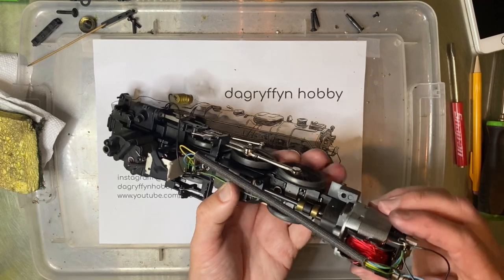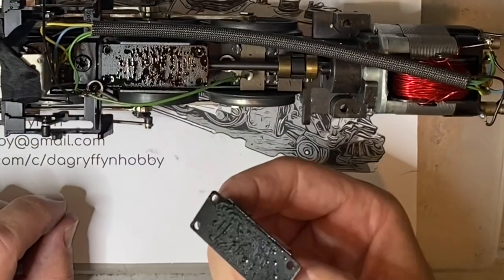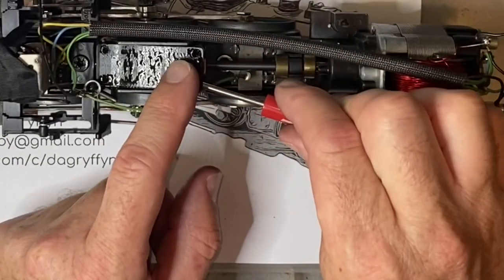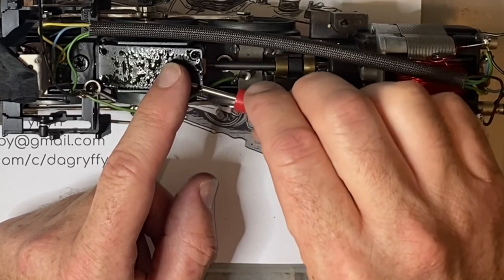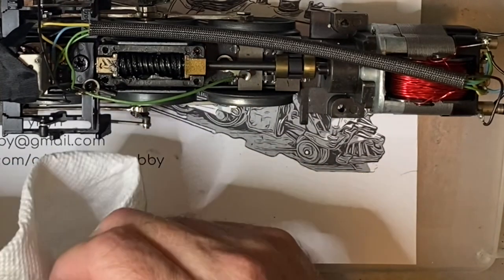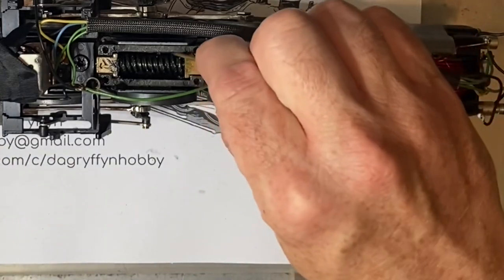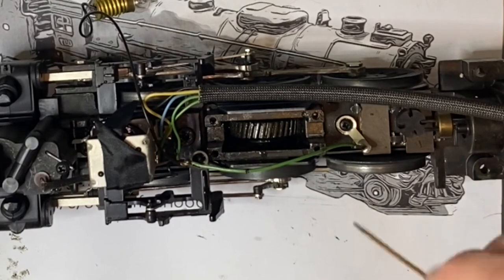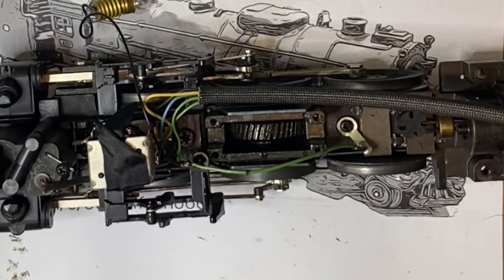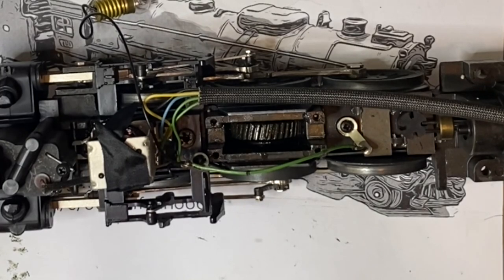It's also a good time to make sure to check everything and make sure none of the wires came off. Add a couple drops to the wick. Okay, so there's no reason for there to be lubrication between these two plates here. A little gummy in there — looks greasy. So I spent some time cleaning a lot of the grease out of here. There's definitely still going to be some down on the bottom. I cleaned out the gear teeth. So I put LaBelle 107, just a dab on each axle where it touches the body. I'm going to use the 106 on the big gear here.